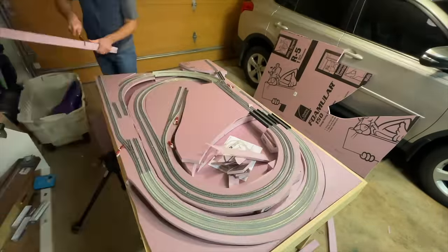When soldering rail joints, like with wires, I try to apply the heat to one side and the solder to the other to help ensure I'm getting a good solid solder joint. Since the Unitrack roadbed is actually plastic, it may soften while you are doing the soldering. So be sure the rail joints are still aligned after the solder cools. If they are not, you can just come back and apply some additional heat, push the rails back into alignment, and then you should be good to go.